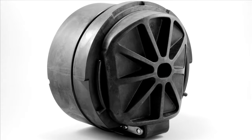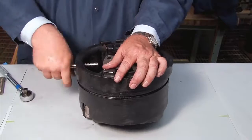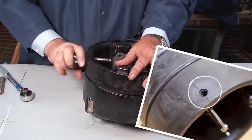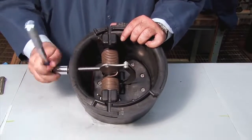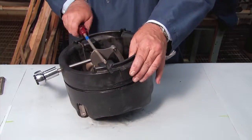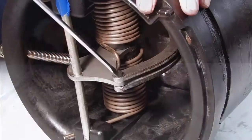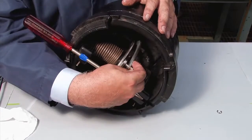The procedure to open the checks found in the 6-inch assemblies varies slightly from that of the smaller sizes. To open the checks, thread a one-half 13x5 hex bolt through the service hole located on the bottom of the check until it makes contact with the linkage. Continue threading the bolt until the hole on the cam aligns with the service notches on either side of the check, then place a number three Phillips head screwdriver through the hole in the cam. Slowly unthread the service bolt to transfer the tension to the screwdriver. Remove the E-clip and pin and inspect the check in accordance with the previous procedure.